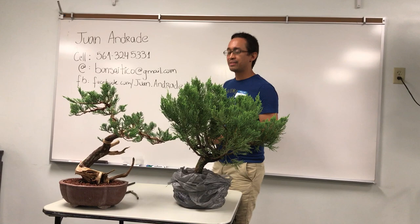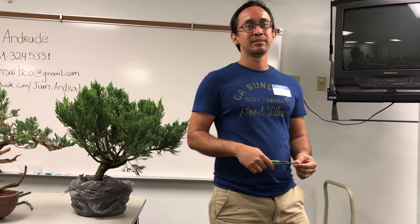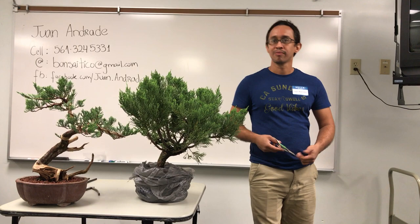If you were going to order that online or something, what would you actually be requesting? I've gotten it at landscape businesses, online. Yeah, just ask for river sand, and they can hook you up with rocks, because that's what it is. You're talking a 1/16 to an 1/8 of an inch kind of size. Yeah, exactly. That's hard to come by. It is. I have some, but I don't use it much. I use sandblasting sand, because you can buy it in different sizes, and you can get coarse sandblasting sand, and you start getting stuff that's a 1/16 of an inch. Yeah, that would be ideal.